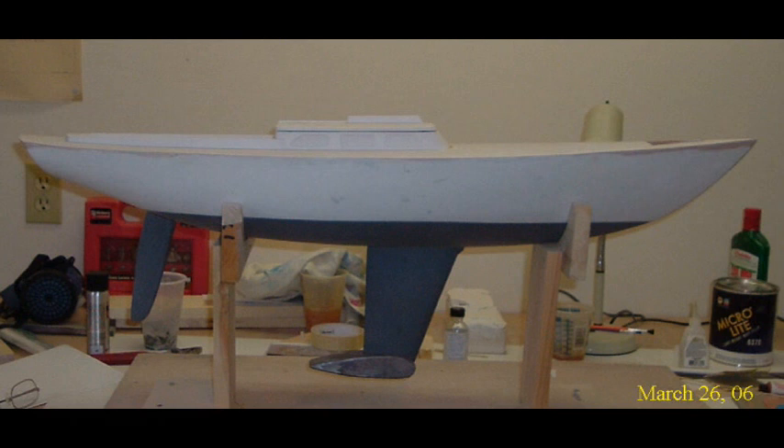In order to maximize hydrodynamic forces on the keel and on the rudder, I decided to use actual foils rather than just flat plates. So I built the keel and the rudder using NACA foils. The rudder is the same form factor as the real rudder on this boat — it's just deeper and has a longer chord — and the keel is also deeper and has a somewhat longer chord than on the real boat. I'll get back to the ballast a little bit later.